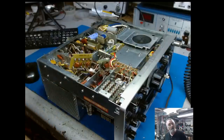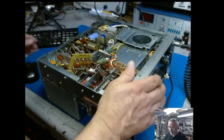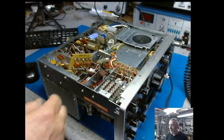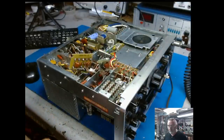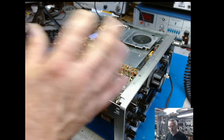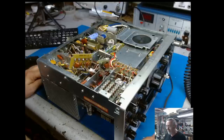Okay guys, from the last clip it's been a week. I had some technical difficulties with this radio. Now you remember in the YouTube video this radio was receiving and transmitting. Well I came in to start the alignment process. You already saw where we went ahead and removed all the glue off the coils. Then the next day I came in to start doing the alignment. The first thing you've got to do is tune it up on the high band of 10 meters. I noticed there was no output. So I started looking and said well maybe one of the tubes has failed. I went ahead and just replaced all the tubes just to see — still nothing, no output.